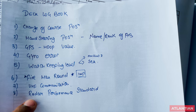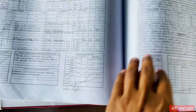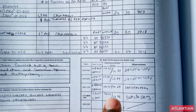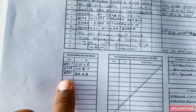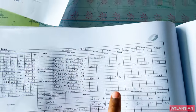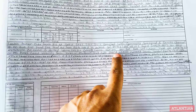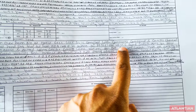If your radar performance standard is recorded in the deck logbook, it must be checked every watch. Fire safety and security rounds shall also be recorded. HDOP values or your DOP value shall be recorded in each watch — this has been checked by vetting inspectors. For hand steering, in each watch you must mention that you have tried it out — for example, 'vessel on autopilot, hand steering tried out from this time to this time at this position.' This must be recorded for each watch and has been checked.